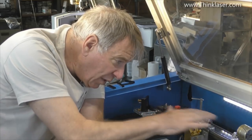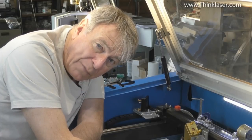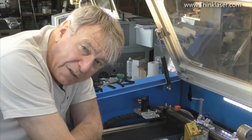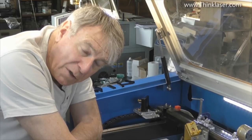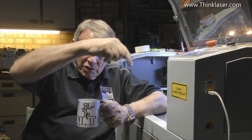So what do we learn from this first session? Even though we've got silky smooth traverse action and a lovely continuous power, we still get striations in acrylic when we try to cut it. Those people who said striations are induced by the stepper motor were perfectly correct - but not entirely so, because there's another natural set of striations in the background. Now you know that regardless of how we try to get rid of striations, it's a natural part of cutting acrylic. What we're going to do next is look at how we overlay those natural striations with machine-created striations from the stepper motor.